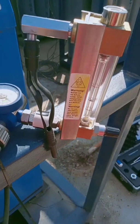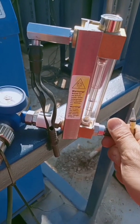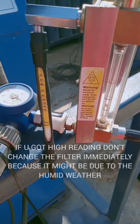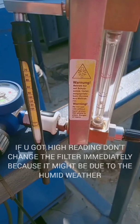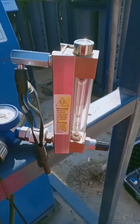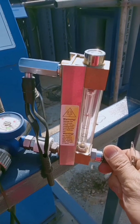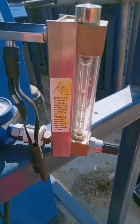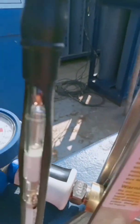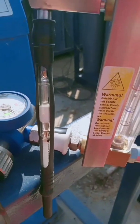The next test is for H2O. You're gonna set your float to blue, then insert the tube and wait for five minutes. After five minutes, take the reading. The next tube we're going to test is for oily content — you need to set your flow to red. Break both ends of the tube, make sure when you put it on, the small tube is on top, and wait for eight minutes.